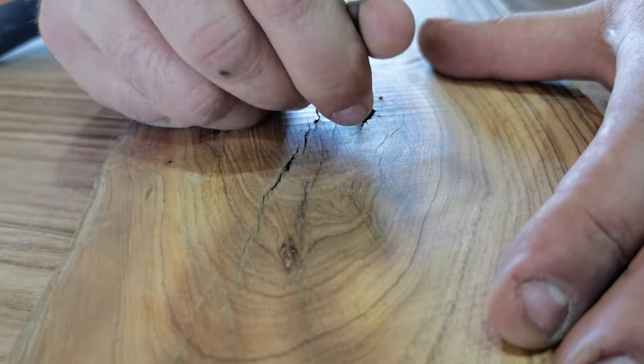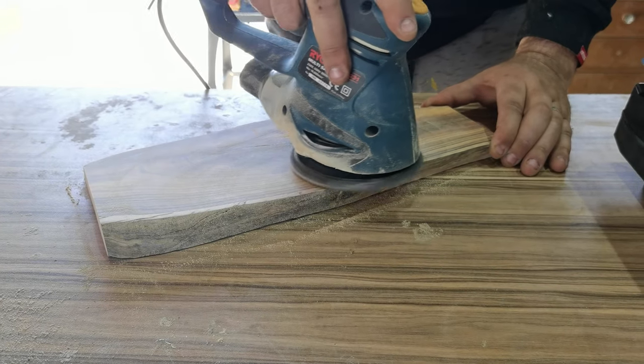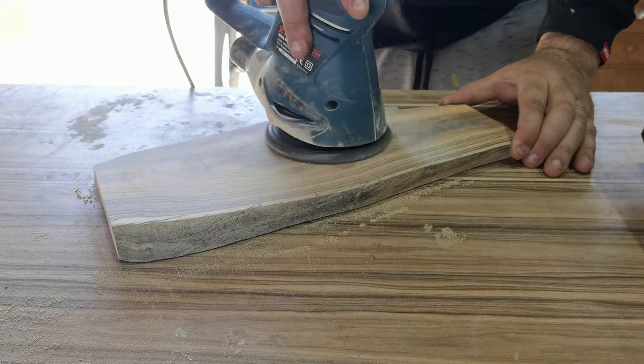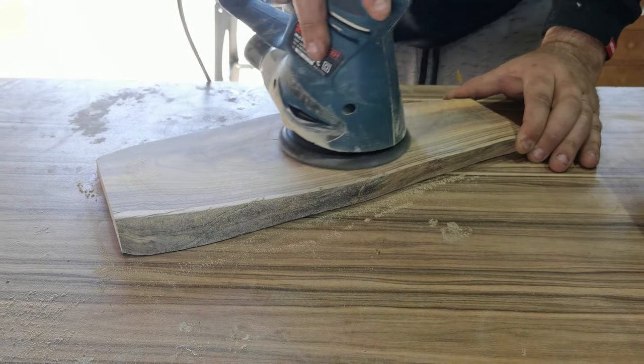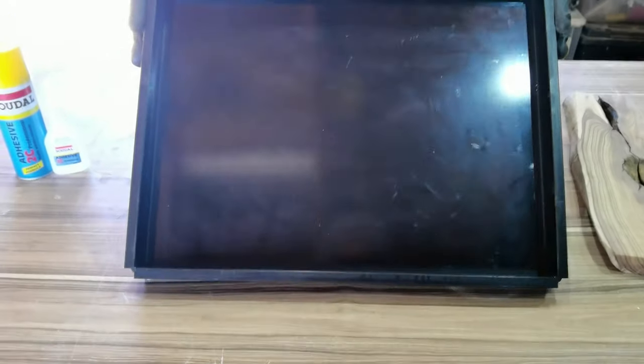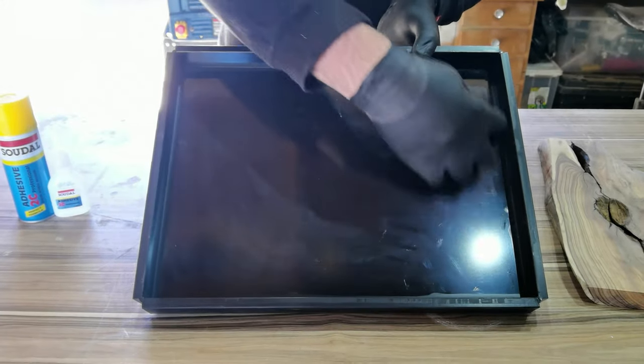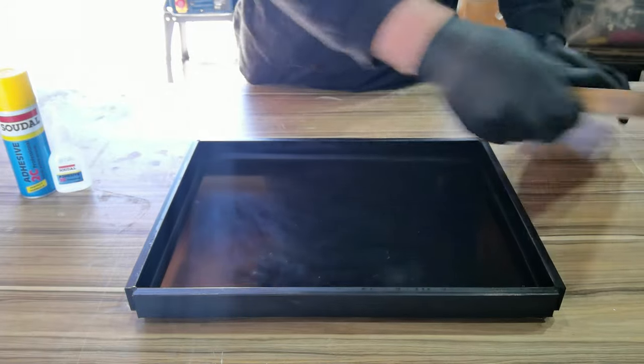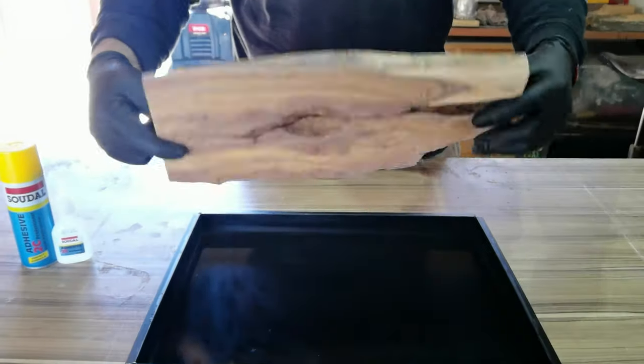Here I'm working with wild olive wood and I've just run it through my planer, picked out all small bits of dirt I could find in the wood. Then I gave it a light sand up to 180 grit to get rid of any marks left from the planer. We'll sand it properly again later when we release our board out of the mold. We also sell these pieces of wood cut to size for these molds if you'd like to purchase the wood from us.